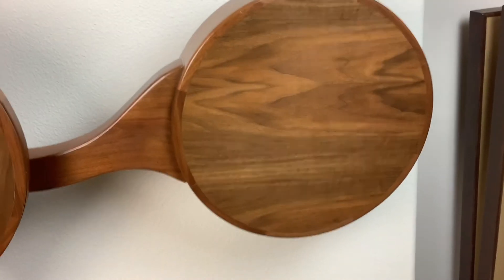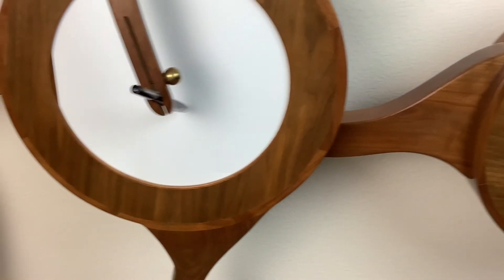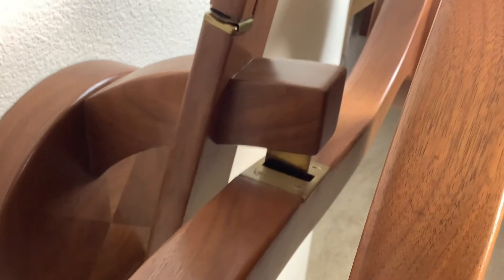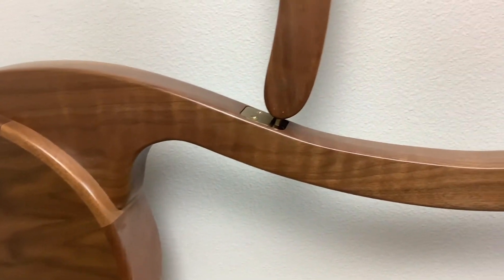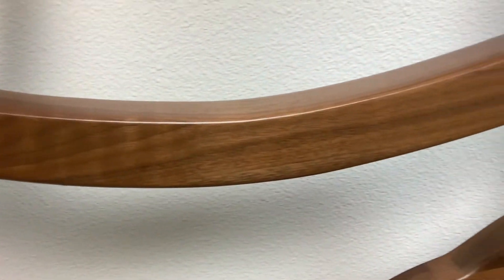A 16-inch diameter weight wheel, three and a half inches deep, is connected to the right end of the pendulum bar of the first vertical pendulum. The left end of this bar supports the pivot for the first horizontal pendulum. The first vertical pendulum pivots on a knife edge that mates with a V-shaped groove in the brass bar that is part of the wall-mounted structure. The top end of the first horizontal pendulum bar is connected to a second weight wheel; its pivot is in the middle. At the bottom end of this bar is the pivot for the second vertical pendulum. The left end of the second vertical pendulum bar is connected to a third weight wheel; its pivot is in the middle. At the right end of this bar is the pivot for the second horizontal pendulum.